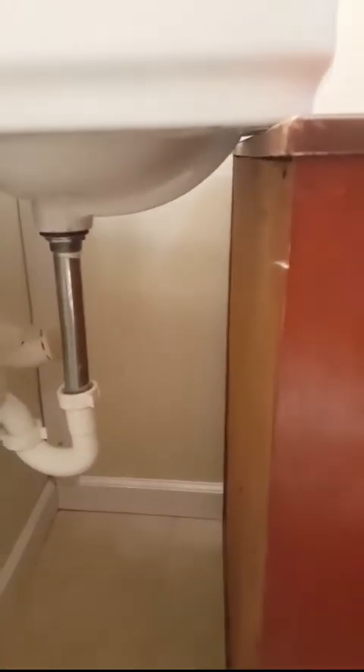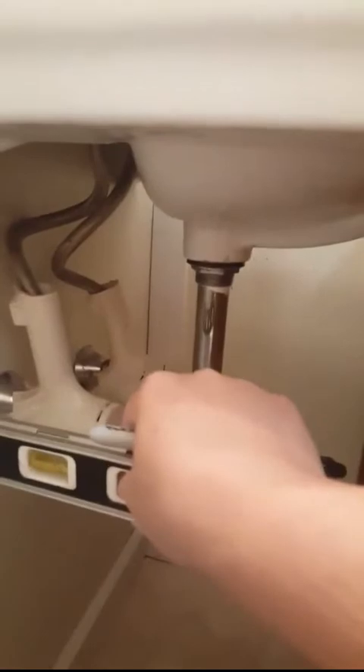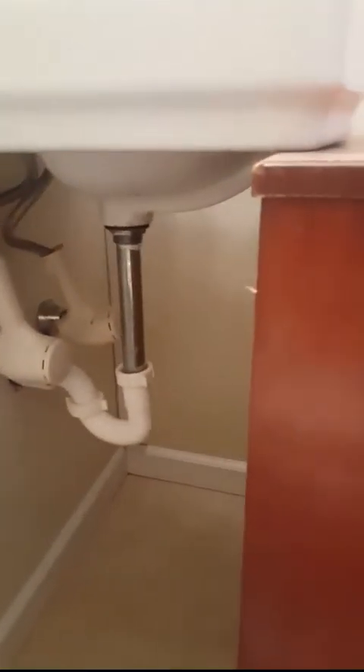It's actually the perfect height and depth — everything just kind of worked out. I thought, why spend money on something new when I have this and I can put some doors on it and transform it, since it is solid wood. Right now I'm measuring where I have to cut because I need to cut some of the back out to slide it over all the pipes. I'm marking depth-wise and length-wise to figure out where to cut in the back, then reinforce a little bit so I can use the shelving inside. If it's too much for me I'll wait for my husband to get home.